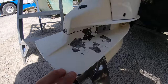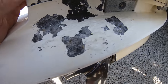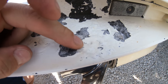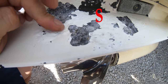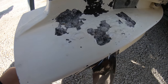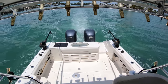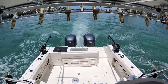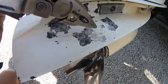If you are looking over your boat's lower unit and you see something like this where the paint is chipping up and it looks like it's got bubbles coming up under the paint, you most likely are looking at galvanic corrosion, and it could end up costing you a ton of money to fix it if you let it go for too long. There are many different types of corrosion that can be seen on a boat — anytime you take a battery or electricity, an engine, and drop them into a body of water and allow that electricity to flow throughout the boat and the engine, we are going to see some complications and different adverse effects.